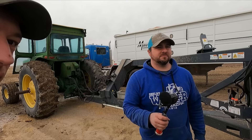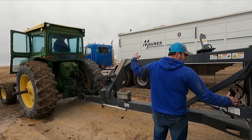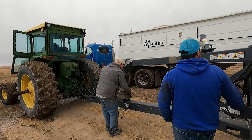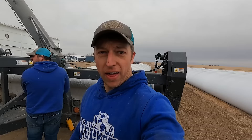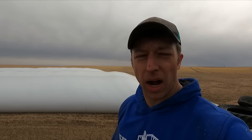Let's try not to break a shear bolt. I think that dial is turned down - yeah, this is way too fast. Two full turns, we'll see what that does. That's what was going on - we just had it running too fast. There's a speed adjustment on how fast it pulls the extractor through the pile and it was turned up too much. The truck's almost full - in fact it's really full. We're going to have to get better at filling trucks. All right, time for another truck - the International.